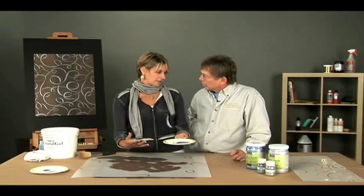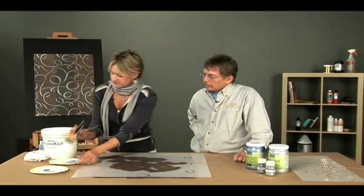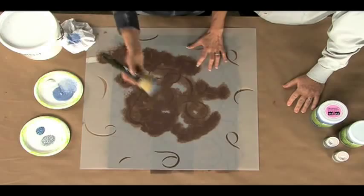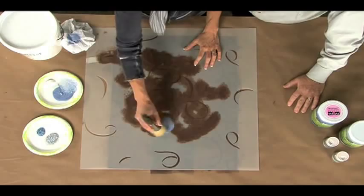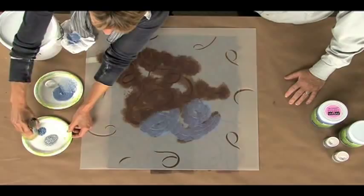The more Crystal Gel you use, the more texture you're going to have. And if you went up and felt the wall with your hand, you would feel a raised edge, which is sort of nice. So this is already mixed up and I'm going to start by stenciling. I'm going to offload it a little bit on this rag — I usually use a rag or a paper towel on the job. And I'm going to go in and hit just like I did before with the pouncing motion. Same heavy concentration of material — not too much that it's going to seep.